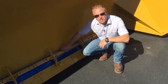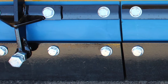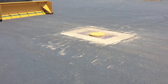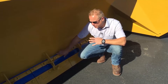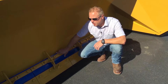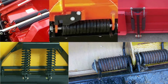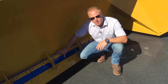What you're seeing here is our Steel Edge trip mechanism. We're still utilizing the polyurethane like we've been doing for years. This polyurethane was designed specifically for this application — it's a patented design that Pro-Tech came up with about 10 years ago. This polyurethane can last anywhere from 4 to 6 years, reducing cost of ownership. You don't have to deal with pins, bosses, springs, or a lot of moving parts, so maintenance and functionality are considerably better than some other containment plows out there today.